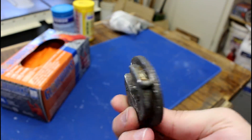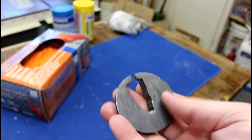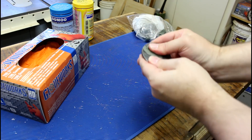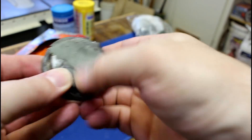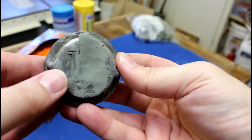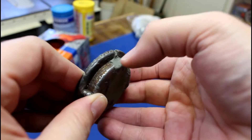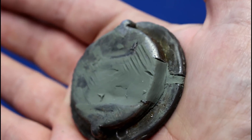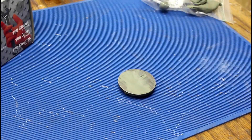Another thing that makes this more complicated is that we want to mold this solid, which means we need to fill that hole. I'm going to use just some molding clay for that. The underside isn't as important — it will never be seen and it doesn't affect the function. But we do need to make sure we push back this ridge here, and we've done that and molded it around so it should slip back in easily enough.